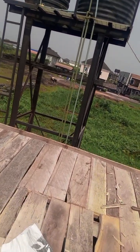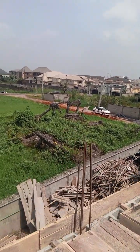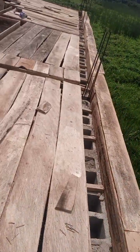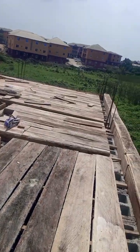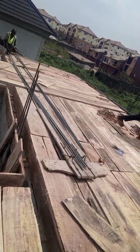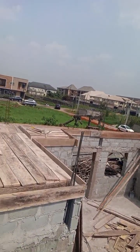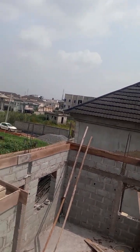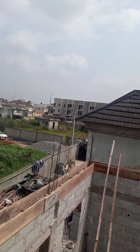We are spreading to you these concepts that we are using here for our first floor slab. We are running the beam around the building. This recess you are seeing is going to be an internal beam, all through — these are connecting beams. The connecting beam will be running through, and this is going to make it more stable for the first floor to avert differential settlement, so that the building at the first floor will also have the same strength as the foundation.